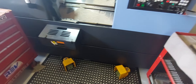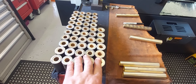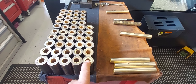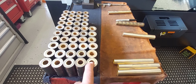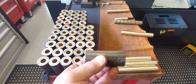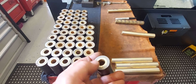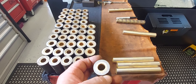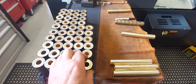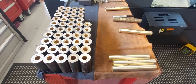I'll take you over for another bit of a look. So these are parts that are left over — the steel bushes were left over from last time. I made more than I needed. It's a little bit of an ongoing job as the customer needs them. So it's just a steel outer with the bronze bush inserted inside. They do get pressed in to some degree — they're a pretty neat fit. Obviously you don't want them falling out. And then they'll get bored on the ID and faced off.